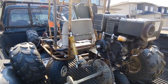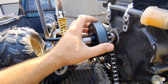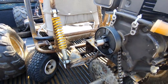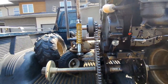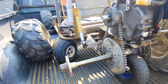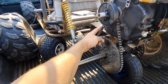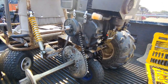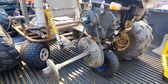My clutch finally came in the day after. Got it installed — it's a 14-tooth for a 1-inch axle, just tightened in there so far and looking pretty straight. Got the chain on — it is a little bit loose, but I want to put a tensioner on this side later on because it will loosen up. It's not a pre-stretched chain.